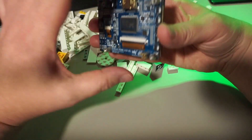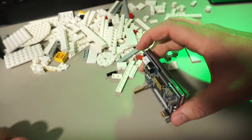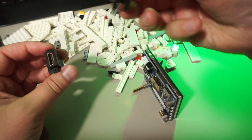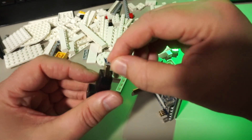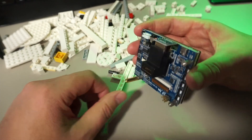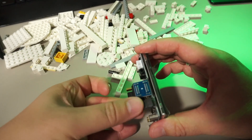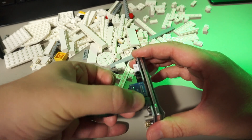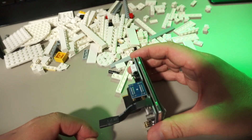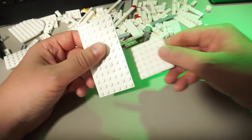Let's first prepare the screen. I used one of the standoffs to make it easier to keep the screen in place and upright — I'm not going to put screws in LEGO bricks. I used the HDMI bridge to route the HDMI cable to the back of the unit, along with an angled HDMI adapter from AliExpress. I also used a very flat USB-C cable from AliExpress to route the USB-C connection to the back. Mine is 5cm long, but I'd strongly advise getting a longer one if you're building along, as this one made it hard to tuck away the cables inside.